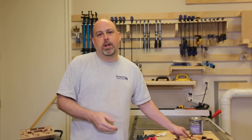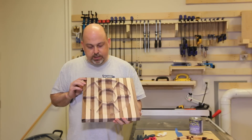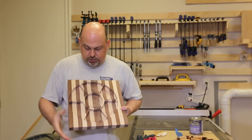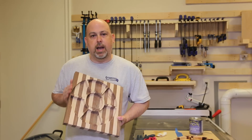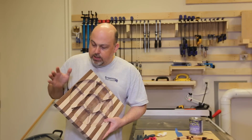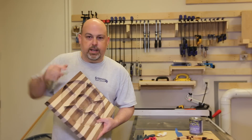What about the one I made on the X-Carve? Well, I never finished it — here it is. The homing sequence did not work. It started in the wrong position, and as you can tell, the entire bowl is shifted up about half an inch, which means it ran out of room on one end. I figured that out about halfway through the carve since it was making the cups one at a time. I decided to let it finish anyway because I could glue on another piece of maple and then put it back on to cut out the outside.